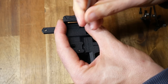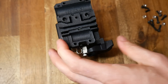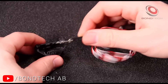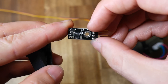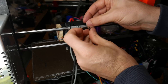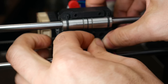The instructions are clear if you take it step by step. The top two LGX bolts are removed, we add the adapter and the LGX together, and use some longer bolts to secure the two as one item. There's a lot of focus put on cable management, just like the original Mark III design, so everything is kept tidy as the electronics are added back on. This kit appears to be made for the Mark III S, not the standard Mark III like I have, which means I have the old optical filament run-out sensor — it's incompatible so I've put it aside for now. With our sub-assembly complete, we insert the final captive nuts and commence adding the printhead back to the printer, utilising the existing system of cable ties over bearings. The belt for the X-axis is inserted into the new part the same way it was in the original.